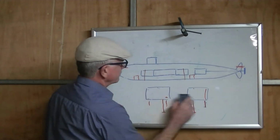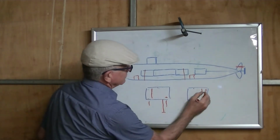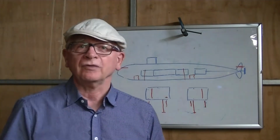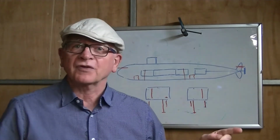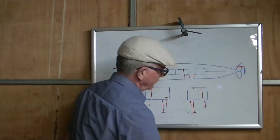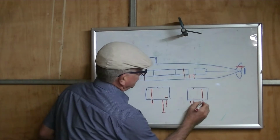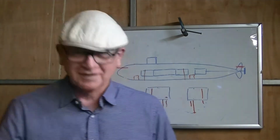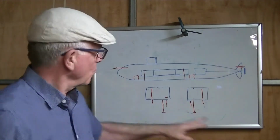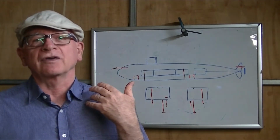And the pistons were sort of like that and like that. So, connect it up to the serial port, find out what those positions are, put them in the code, and we have new positions for the pistons. They are now there and there. That's pretty exciting. So that means that when I surface the boat, it sits at the right position. When I put it on dive routine, it goes to neutral buoyancy, and when I put it on surface, it goes to surface.